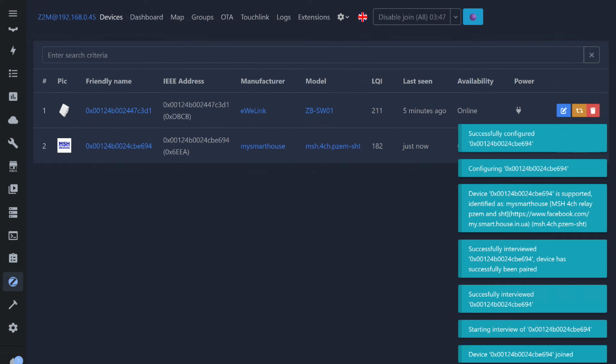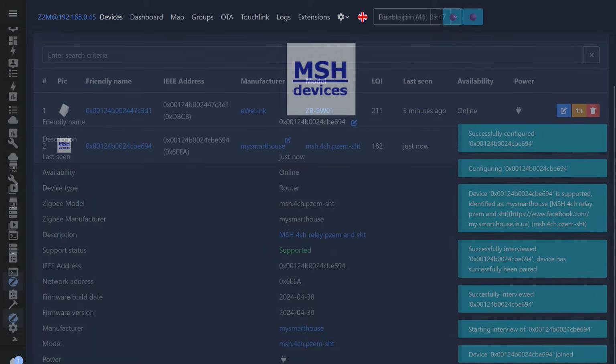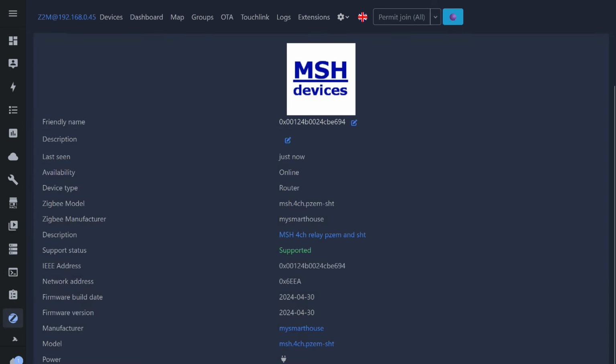By default, the device is already in pairing mode after the first power-up, or you can press the reset button on the board four times. The converter is installed, so the connection proceeds smoothly. Since the device is designed to connect to stationary power, it has router firmware that allows it to transmit data from other nodes in the Zigbee network, thereby expanding its capacity and coverage.